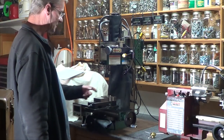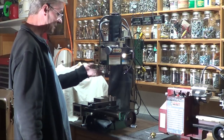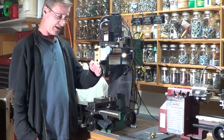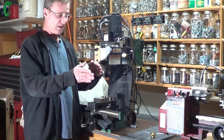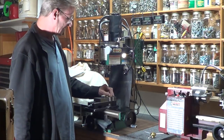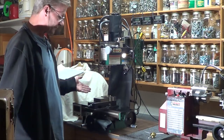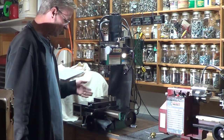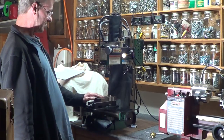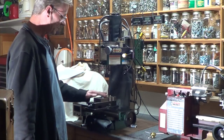The fourth one is a square vise. Everybody's seen me making the soft jaws and discovering my vise was not straight. Because if you have a jaw that's tilted and this one's straight, your work isn't being held solid. As soon as I got them all squared up, the sounds were different and machining was different. You've got to check your vise out — make sure you've got a square vise and things aren't tilting when you clamp down.